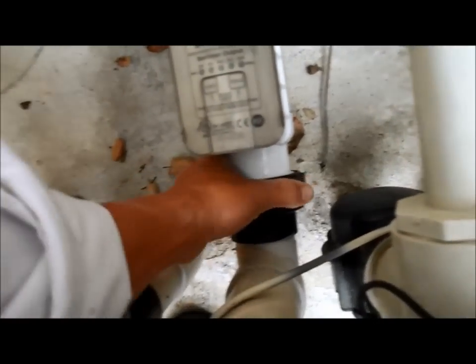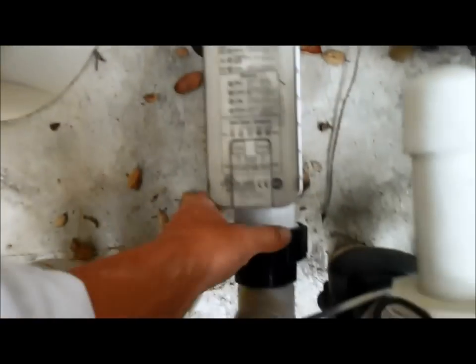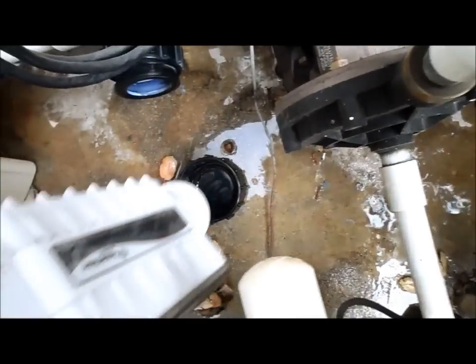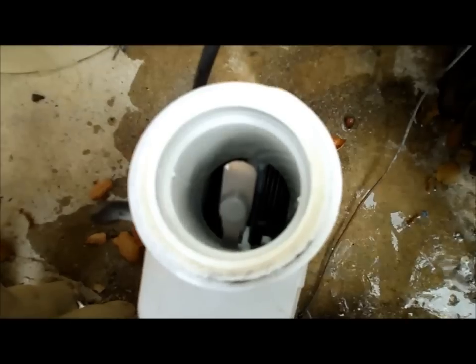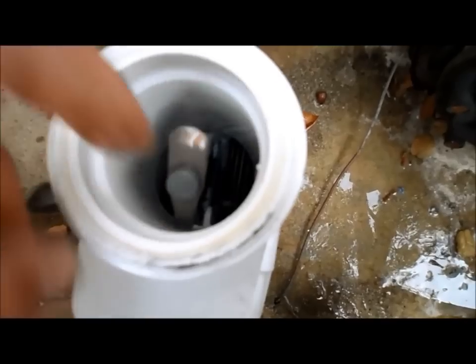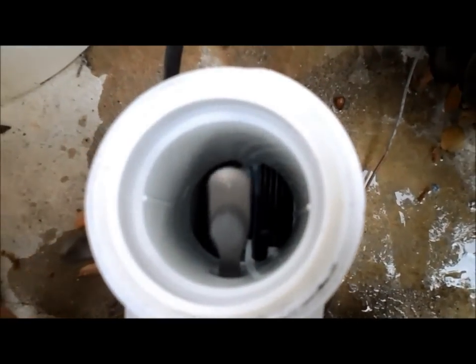Then you just simply unscrew these unions here — they should be hand tight only — and the cell will just pop right off. There's one in the front and one in the back, and there's an o-ring in each one, so be careful when you reinstall it to have the o-ring in there. I'm going to put this on the bottom and screw it on right now. There's a sensor that tells you when the cell is dirty and gives you readings, and I usually leave it on top when I clean it. As you can see, you can see the calcium built up inside the cell — there's quite a bit of calcium build up inside those plates right there. I'll show you how much acid to add to clean it.